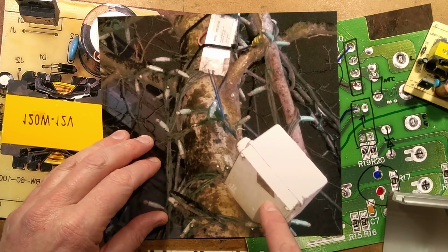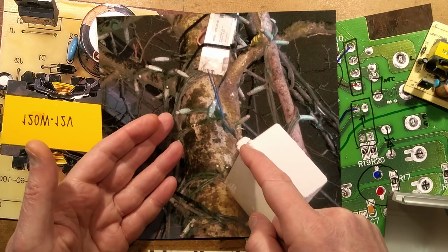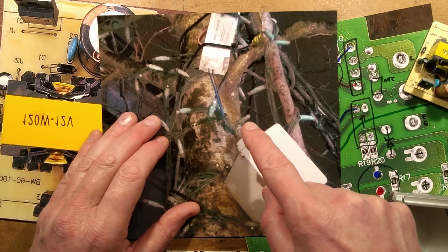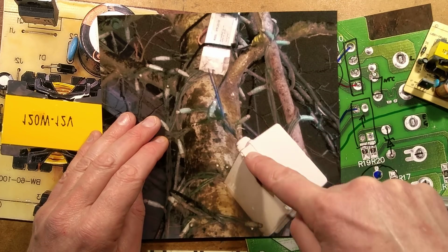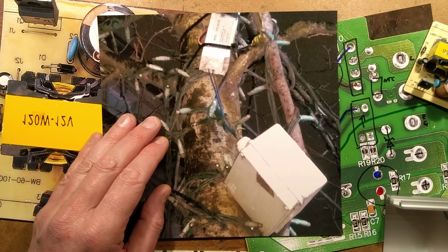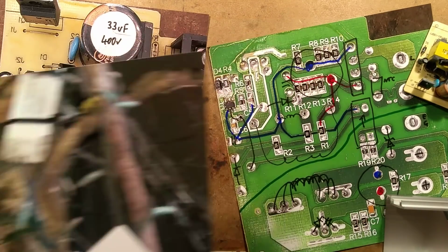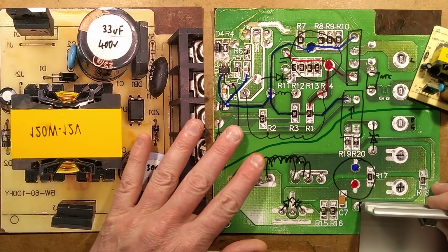And then it's going down to this junction box, and there's a stuffing gland there, and the cable gland can close on those wires if you tightened it up far enough, but it's probably rated for round flex. So the water's going to run down those, and this junction box that's literally hanging off those two wires is just going to fill up, and because it's waterproof, it will fill up to the brim, and well, there you go. But that's what the waterproof ones look like when they're being misused, apparently. Yeah, see if you can identify where that tree is.